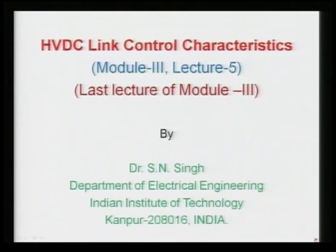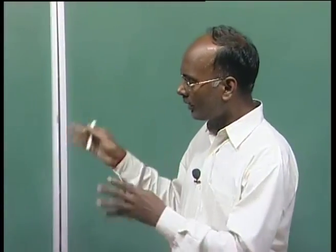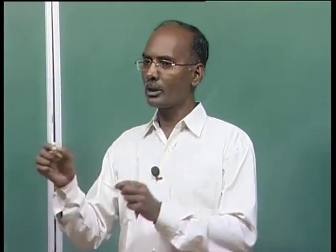Welcome to this last lecture of this module 3, that is lecture number 5, and today I will discuss the energization and the de-energization of the bridges. Here, as I said, the bridge means if you have more than one bridge in any of the HVDC converter station, then you can take one out for its repair or maintenance work.